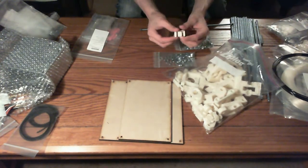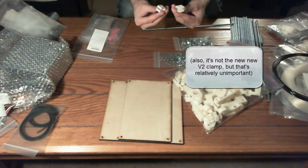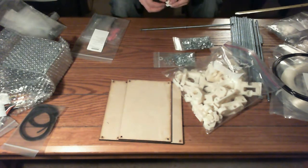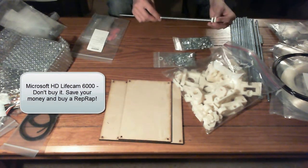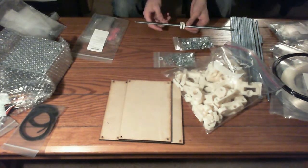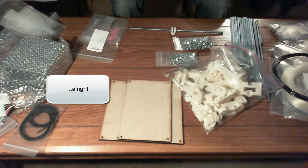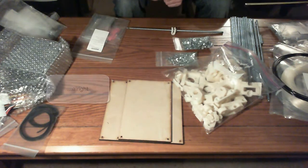So one of these bar clamps here. Take the RP bar clamp and stick this onto there. Washer on either side — there seems to be a general trend where you want a washer between all metal parts and plastic parts. Thread two M8 nuts onto either side of the clamp until they are next to the washer, but do not tighten them yet.